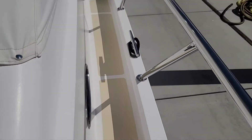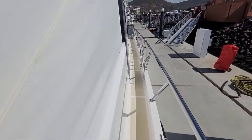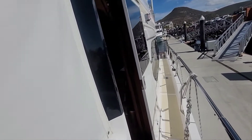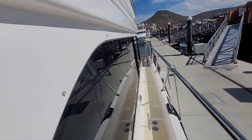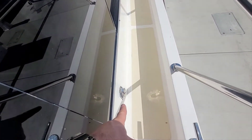Pretty consistent — just on this front section you can see it's just a bit of crazing. That's really just this front section. I'd say some of the deck, the bulkheads and the bulwarks seem to be a lot better. Bit of a chip in the non-skid there, but really aside from that the non-skid's in really good shape. All this is nice — no crazing here. It's all really nice there. Just a little bit more down there. And here is the additional shore power connection, and we've also got both diesel fills there.